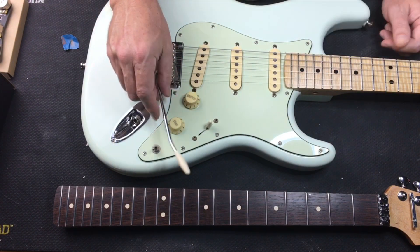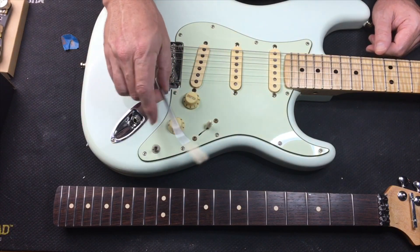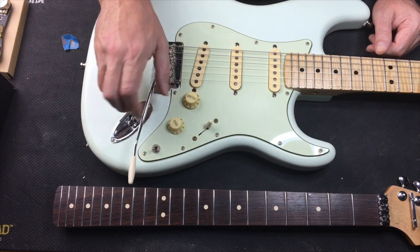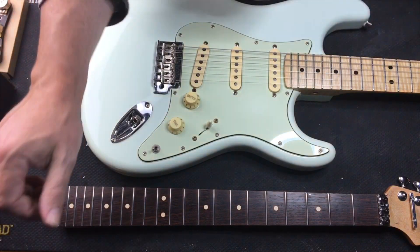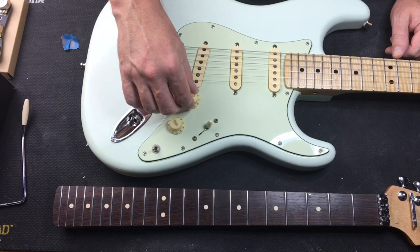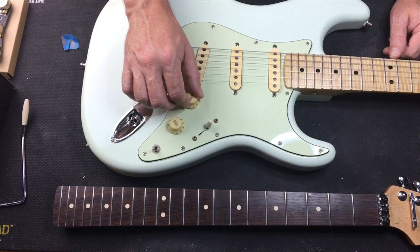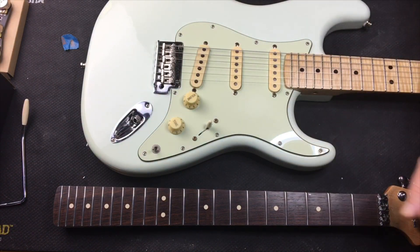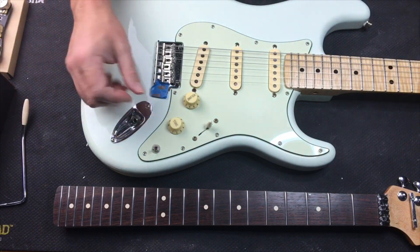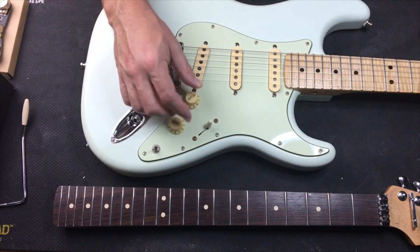The reason why we're replacing this with the Obsidian Wire — I'll put a link in the description below — is that what's going on with this one, it's cutting out. This is old wiring that I reused and repurposed. When I'm turning this up I'm getting all this noise and it's cutting out at full volume, and this potentiometer has probably been in one of my other strats for at least ten years or so, so it's time to replace it. Even the tone pot is getting bad.